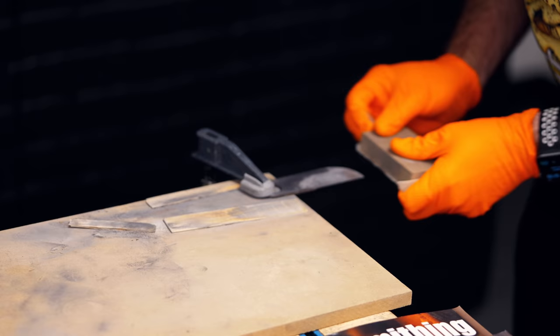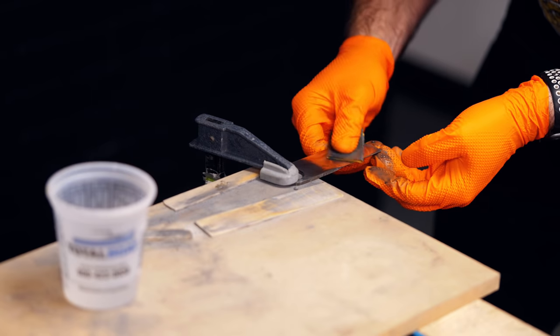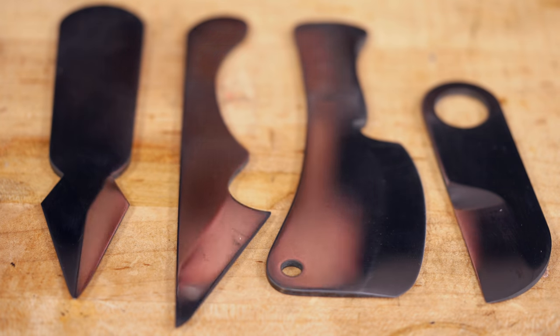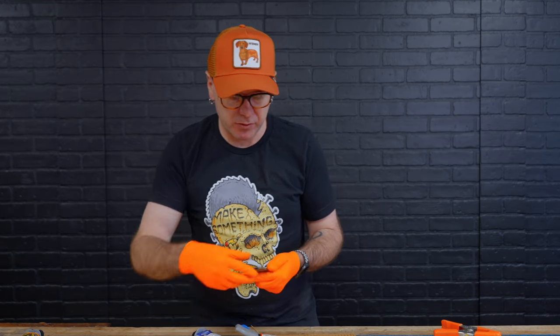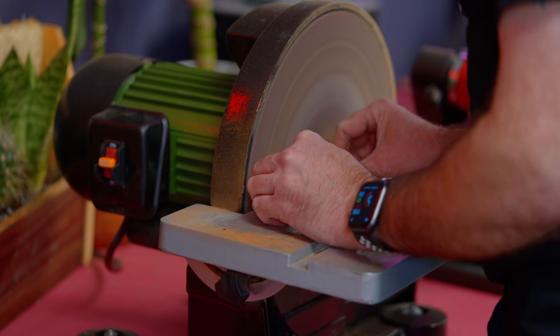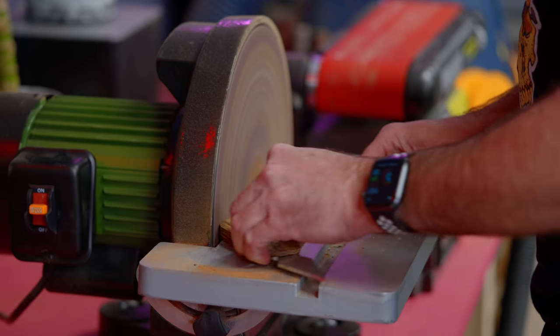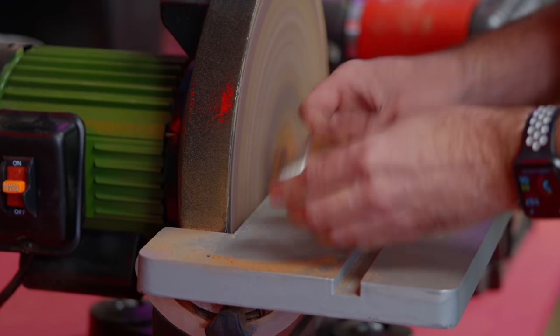These polish really nice — I went from 150 grit all the way up to 3000. It's not a perfect mirror finish, but it's good enough for a box cutter. For the high carbon ones, just like before, we're going to epoxy on the handles. Over at the disc sander, we're going to sand down the wood until we get to the metal. If you cut everything oversize, you shouldn't have to sand much metal. If you do need to sand some metal on your disc sander or spindle sander, unplug the hose to your dust collection because you don't want a hot spark getting in there.